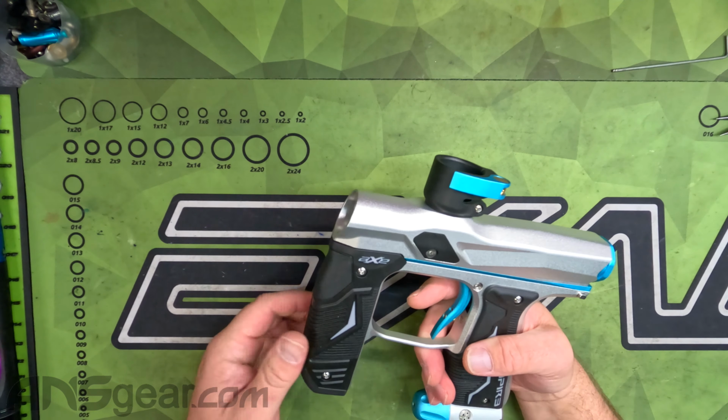So what I'm going to do is I'm going to put this in. Pin in there. I'm going to drop this down inside here, and then I'm going to use a punch or something like this, and I'm going to push up and down on it just to make sure that it moves up and down freely. If you push this down and you take the whatever you're using to push down and off and it's stuck down inside there, your core is rotated and it's pinching and binding that. Another thing that can happen when you're pushing on this, especially if you try to do it with a tiny little Allen key like this, is the Allen key will slip off, and then this thing launches out and you'll lose it. So make sure you're using something that's nice and wide so that it can't slip off and get lost.